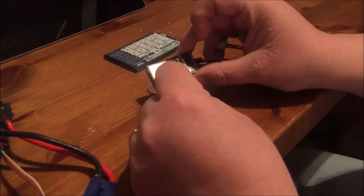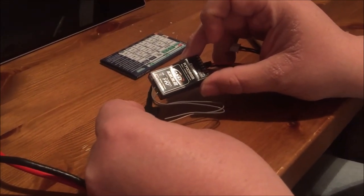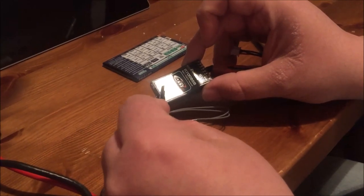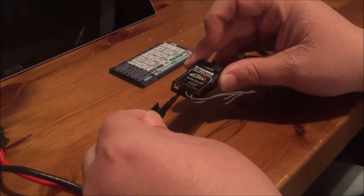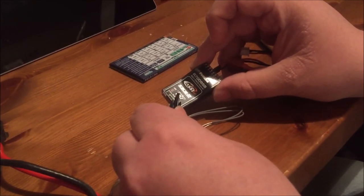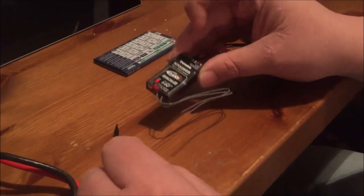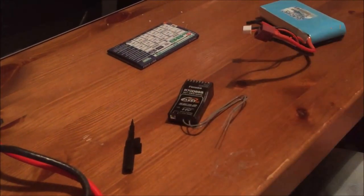As you can see, I've got my receiver turned on — I turned it on while holding the button. I'm in programming mode now. I have a single strobe on this LED, which means I'm in mode 1. To change the receiver to mode 2, I push this button again. Now you can see I get two flashes, telling me the receiver is in mode 2. I need to push and hold this button for up to two seconds. As soon as the light goes green, I'm done. Power down and this receiver is now ready for telemetry.